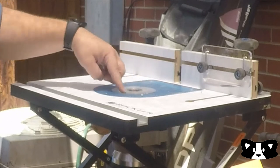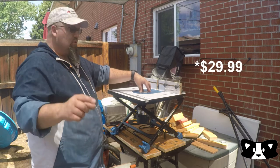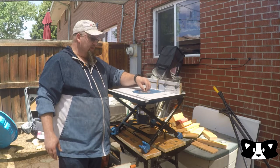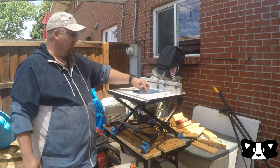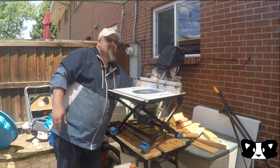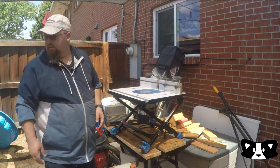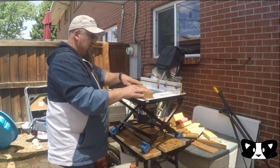There's a third part to the plate assembly: this insert right here. They come with one and there's an additional kit you can buy — I want to say it's $25, don't quote me on that — that has different aperture sizes for different bit sizes. This one is probably the only one I'll ever need personally; it allows just enough for the collet to sit there. If I wanted to change the collet or tighten it out, I've got three screws to undo. The starter pin is just stored back here, and if I'm going to use it, I can put it right here so I can use it to start a piece and then rotate into the bit as it's spinning.